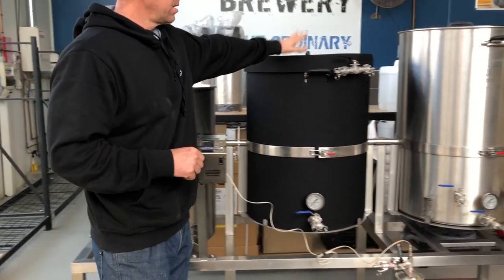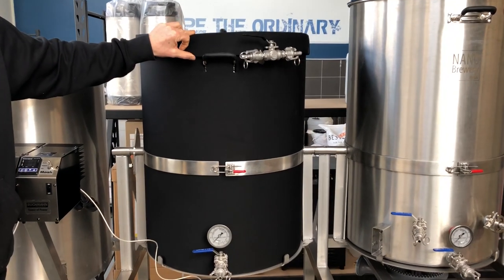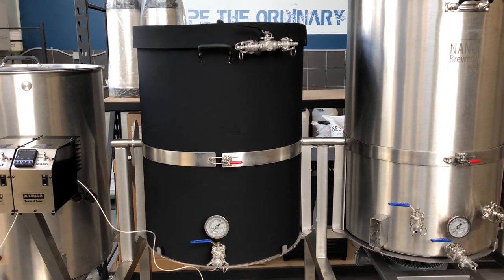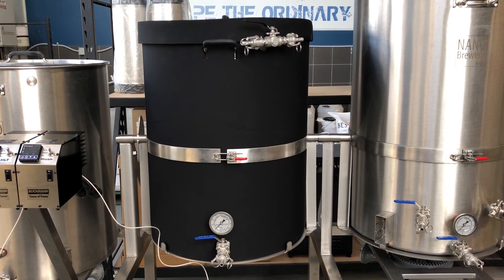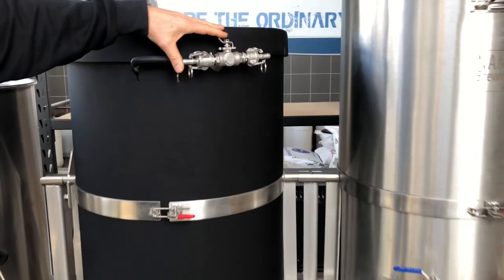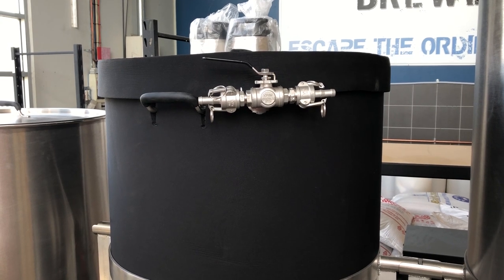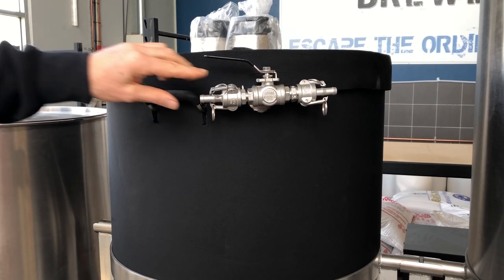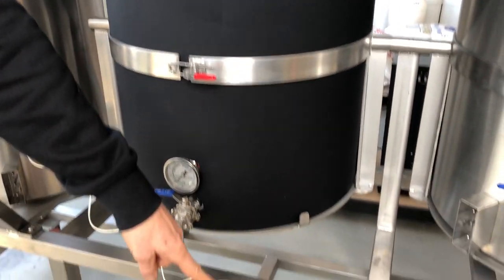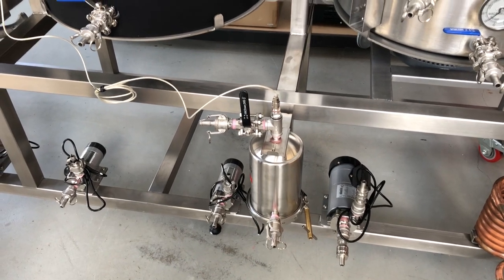In the middle we have the insulated mash tun — 13mm thick insulation. The insulation on this mash tun can hold the mash tun temp to 1 degree temperature loss per hour. On this mash tun we have a double ended sparge arm where we can leave the HLT or water supply to the system hooked up to the sparge, and we can also leave the rims recirculation system hooked up on the right.